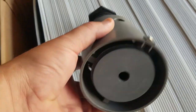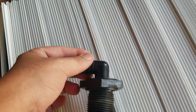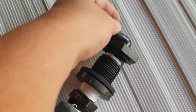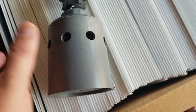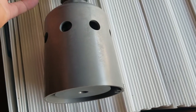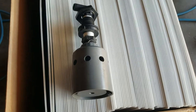Here it is outside of the tank — Hudson float valve, one inch. What you've got is the fitting that we saw outside the tank, a bulkhead here that seals to the tank, and a fitting that goes down to the valve itself. Basically, water comes in here from your spigot and comes out here into your tank. When your tank fills up to a certain level, the water pushes this float up, which closes the valve and doesn't let any more water in.